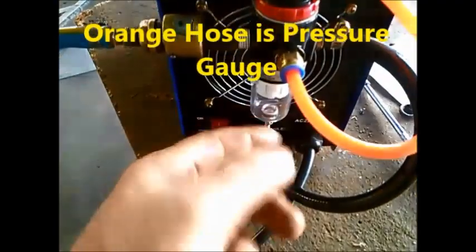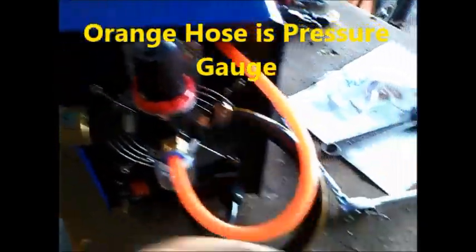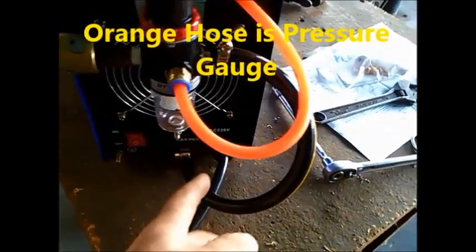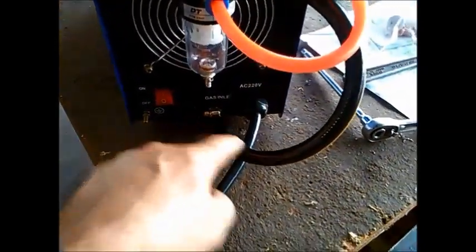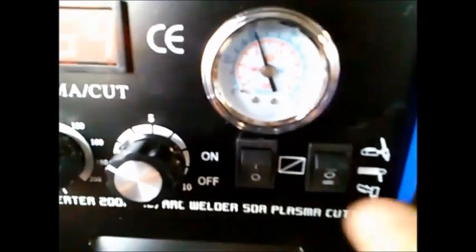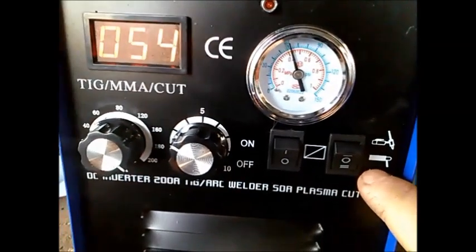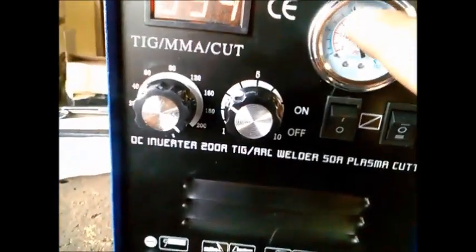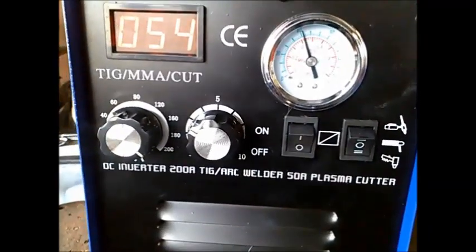Here's a little air dryer — we hook that one up, goes into there. You've got the gas inlet over here, that just goes into the outlet, and we've got the air compressor hooked up. I've just put this on the plasma cutter setting and set it to 60 PSI — it doesn't even tell you that in the instructions.